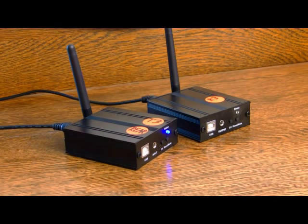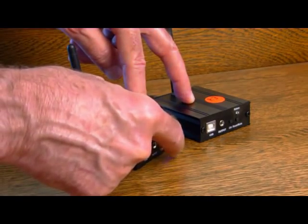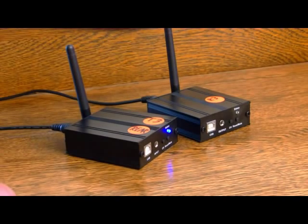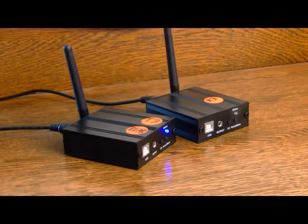In order to have more than one transceiver, you have to set each transceiver on a different channel. The way you do this is by turning off the transmitters on the other transceivers, and then the receiver lights will come on, which indicates that they are not receiving a signal. Then on your third transceiver you change the channel button several times and pair it with the receiver, and once it is paired — the transmitter light here is on and this receiver light is off — the receiver lights on your other transceivers should still be on.